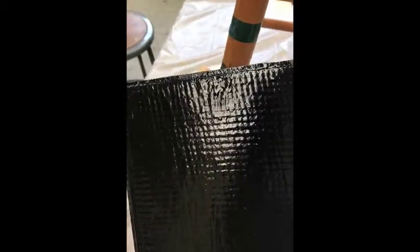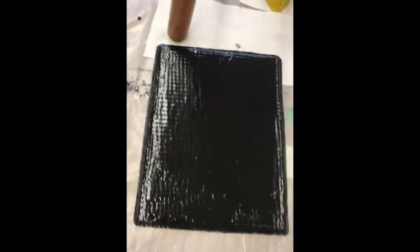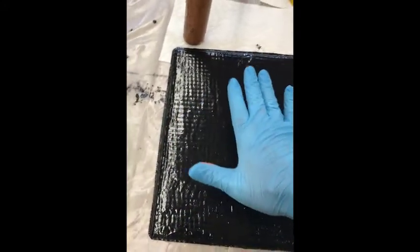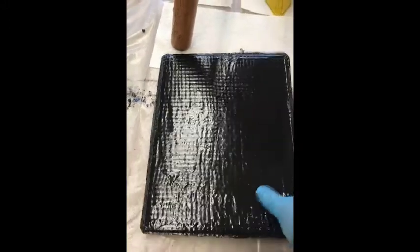Looking at the front side, even though we had fine fiberglass over the coarse fiberglass, you can see the imprint of the coarse fiberglass going through, and you can see up there on top where the coarse fiberglass was pressed around. The edges are trimmed very well and sanded. But really, to make this smooth, we'd have to sand it on the flat part too, and then cure it, paint some more resin on it, and let it dry flat so we have a very smooth surface. So that would take some more time. Anyway, other than that, it's a very good quality vacuum bagged clipboard.